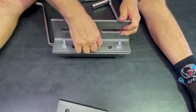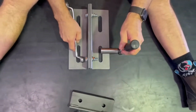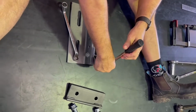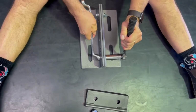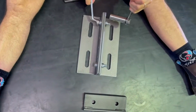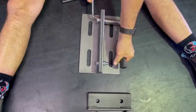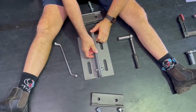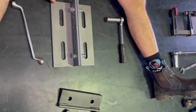If you find that the holes do not line up perfectly, this is the time that you can loosen them off just gently, making sure that the shackle pin that is going to go through those holes can indeed go through them smoothly. We will need a shackle for this, Sonia. So I've just loosened that off a little bit, just to give the plates some movement in each other. We will use a 2-ton shackle.